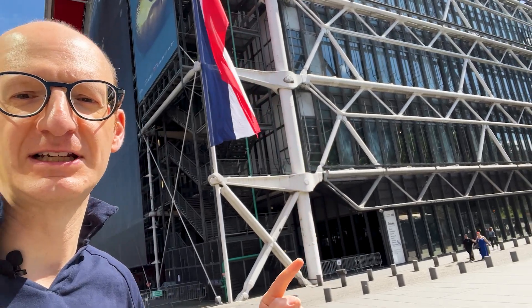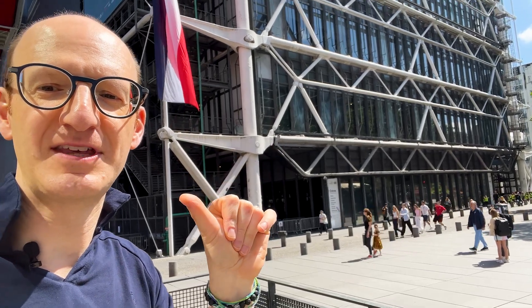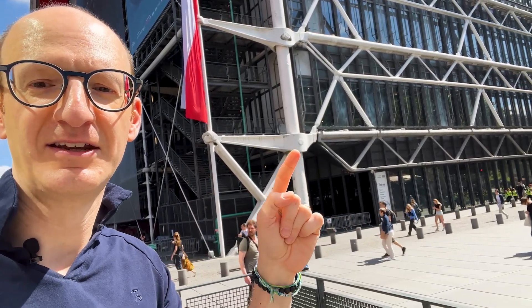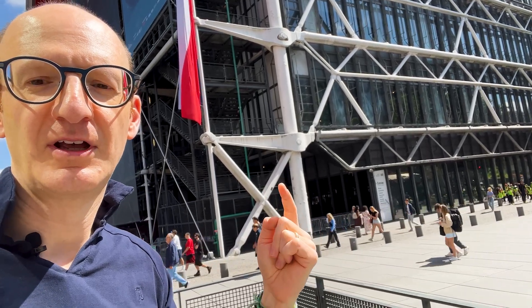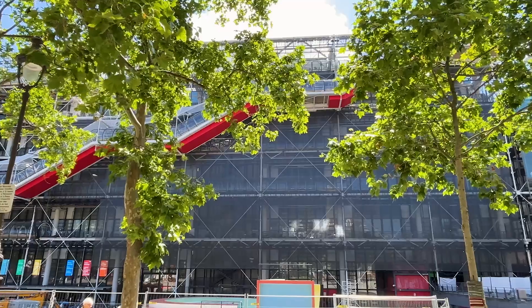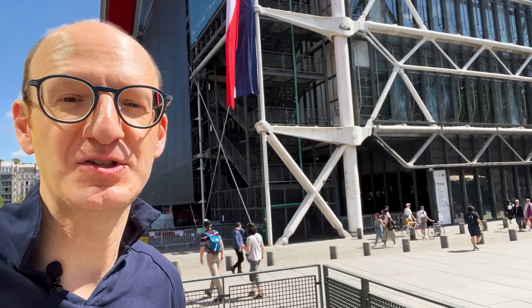Compression is coming down these really large columns. But instead of it just being truss sitting on column, it's truss sitting on a short arm, sitting on a little rocker. This thing is rocking back and forth, and what stops this rocking — because of the trusses — this side wants to rock down, so the other side wants to go up, which puts this rod into tension. That's why this is a solid rod, much thinner, because it's in tension, than the bigger round tube steel section that's all in compression. So the famous facade that you can see under the escalator — that whole facade is in tension. That's why all of those members are so thin.